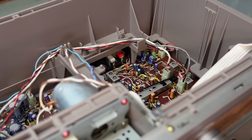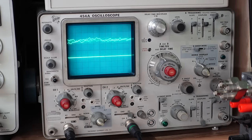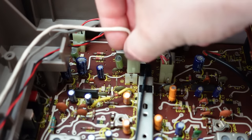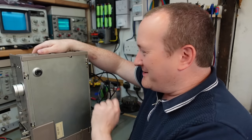That's going to be the first thing we play with - see if we can make that noise go away. Pressing play, we've still got a lot of noise. Let's pull one tape head off - we've lost the sound but we've still got that horrible square wave. Try the other one - oh, I think we've found the problem. Something about that channel doesn't like the input from the right hand head. I'm not convinced it's going to be the head itself.